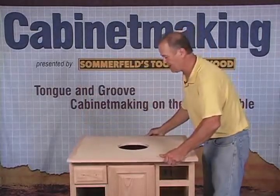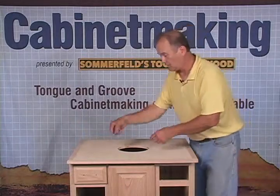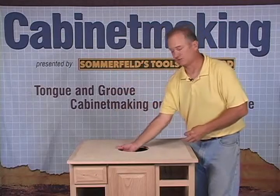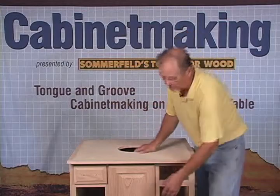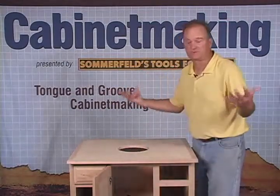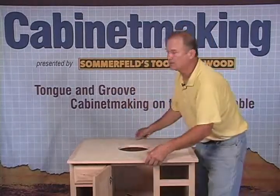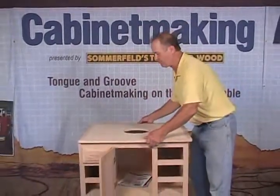So now when you put this tabletop down with the router table on it, you can run the bolts that are underneath there. You might want to get some longer bolts depending on the thickness of your stock you're using here, to get through there. And those 4 bolts will run down through there. And if you want to get wing nuts, if you want to take it off, there's regular nuts that come with it. You can tighten it down, but with wing nuts, you can unscrew it, take this top off. You can take it to a job site if you wanted to, or bring it back and forth however many times you want.